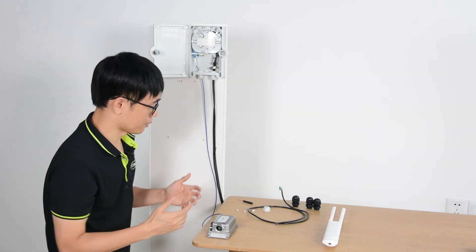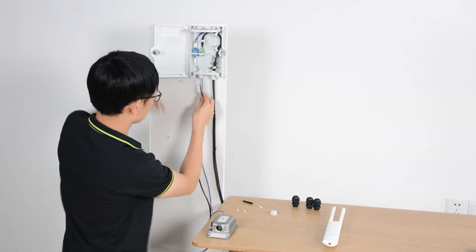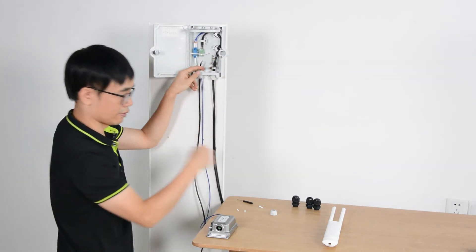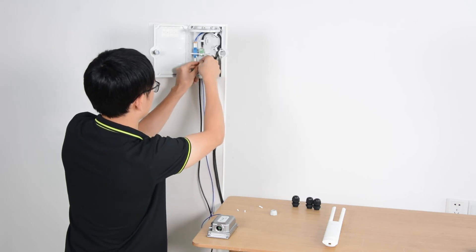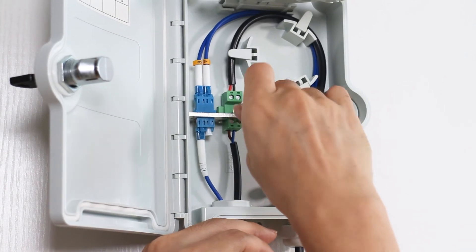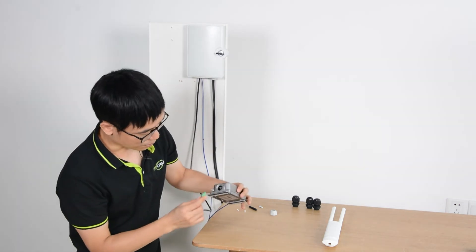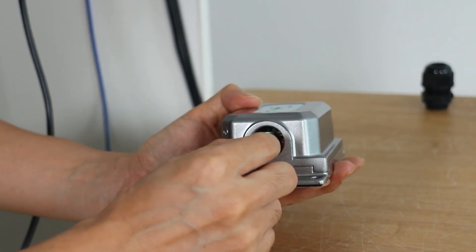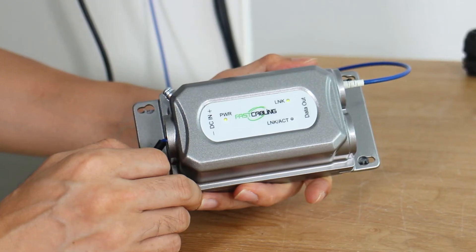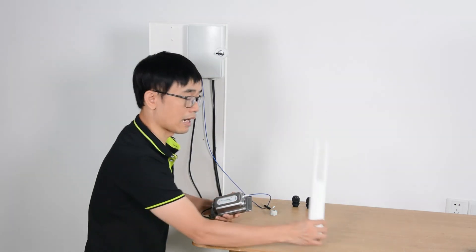The data is ready. We still need the power. Using a short patch cord, we take the power from the power cable. It is important to have the correct sequence — red matches to red, and ground to ground. Now it's ready. Let me close the junction box and power the media converter. Once I plug it in, we can see the power and data indicators are on. The link is on, which means we already have power and data from the back end. Now we can connect the PoE port to supply PoE to our outdoor access point.